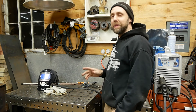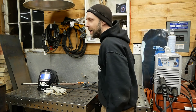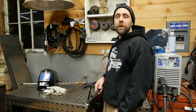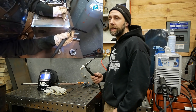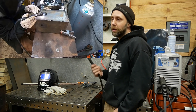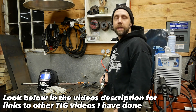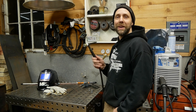One last tip: don't ever forget to turn off your argon gas. Make sure when you're done you turn it off and even double-check it, because the worst thing is to have a full tank of argon, come back a day or two later with the smallest little leak, and find your bottle's empty. Hope you enjoyed the video — this is about a 20-minute basics video on TIG welding. I taught myself how to TIG weld about two years ago; it's been great for welding thin metals, detailed work, and I even welded a 1/16th-inch hydraulic tank for my articulating dump truck. At some point I'll do an AC video on aluminum welding specifically. If you enjoyed the video, give it a thumbs up, leave a comment, and consider subscribing. Till next time, take care!